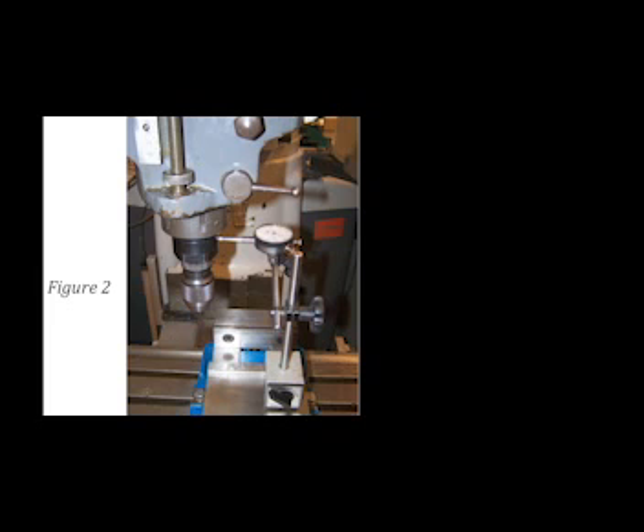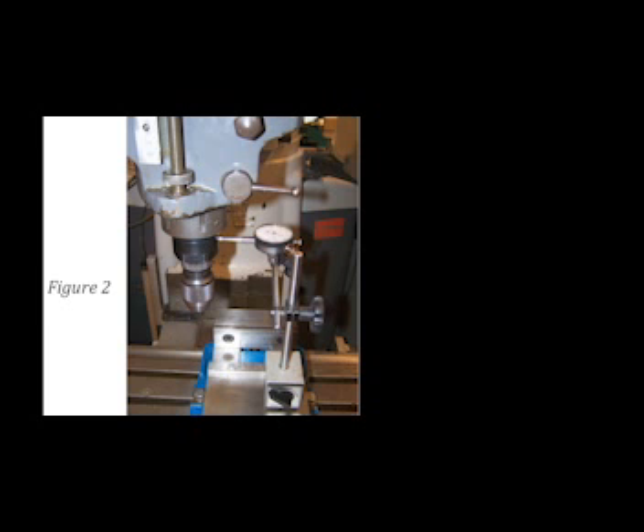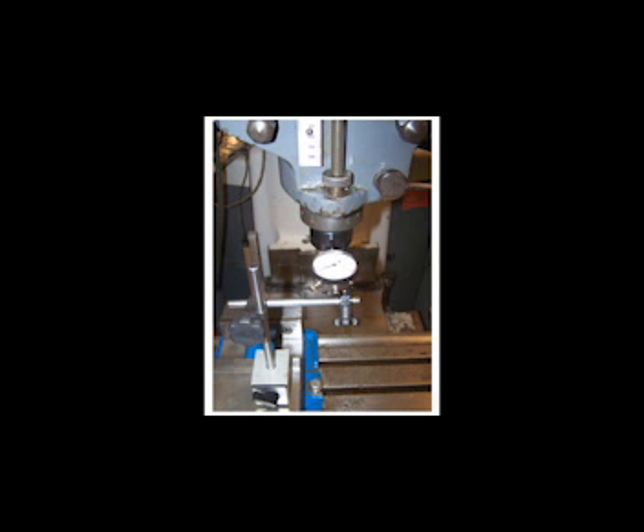To test the X-axis scale, securely mount the magnetic base on the table and place the dial indicator stylus against the chuck's rim, making sure it is perpendicular to the Y and Z axes. Move the table left, then right in the X direction until the needle starts to deflect, then move in the Y direction — the point of maximum deflection will be the center point. Move the table right, then left in the X direction until the dial stops, then move it back until it just starts to deflect. Do not move the table backwards from this point on. Zero both the dial and the digital readout, then move the table in the X direction until the digital readout displays 1.0000 inches. Record both the digital readout and the dial indicator reading. The acceptable limit is plus or minus 0.001 inches or 0.025 millimeters.